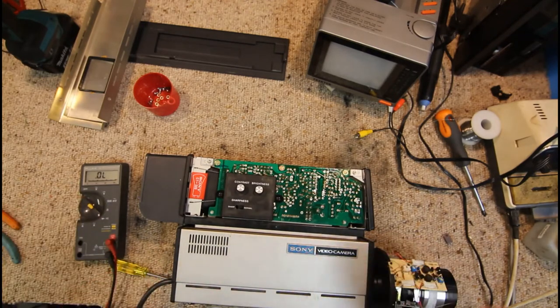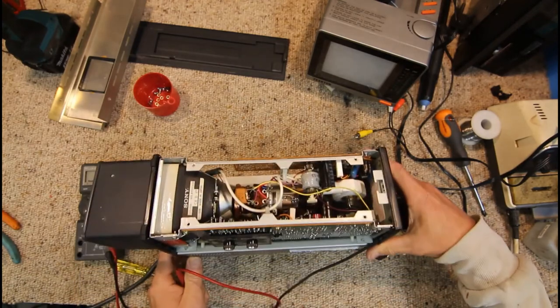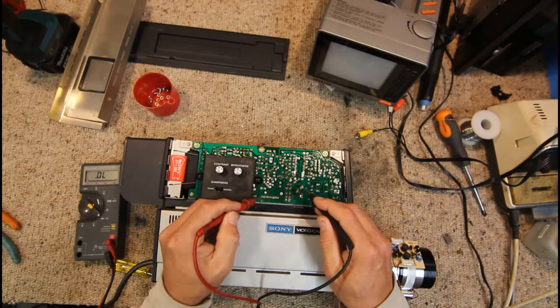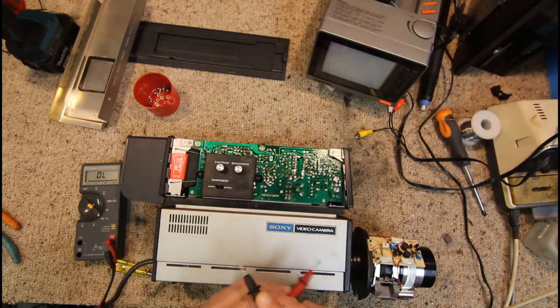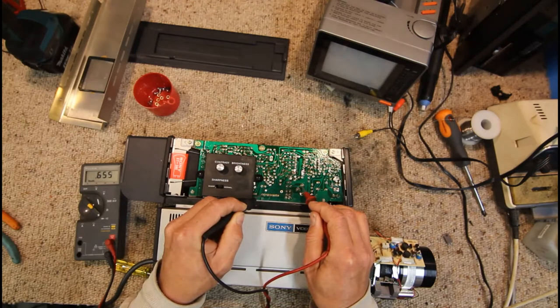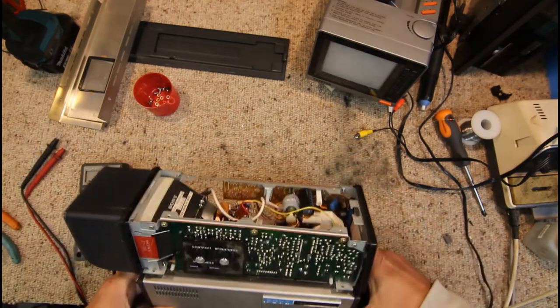Now going to diode test. The transistor is a C1061 — 2SC1061 — so that's an NPN. All the 2SC and 2SD designations are NPNs. Guessing that's the base, but we've got no measurement to what is probably the emitter and no measurement to collector. Trying the other way around — that's actually sitting at 0.6 volts, which is collector to base but the wrong way around. If it were a PNP transistor we'd have positive. We'll find out what the pinout is in case I've got it wrong.